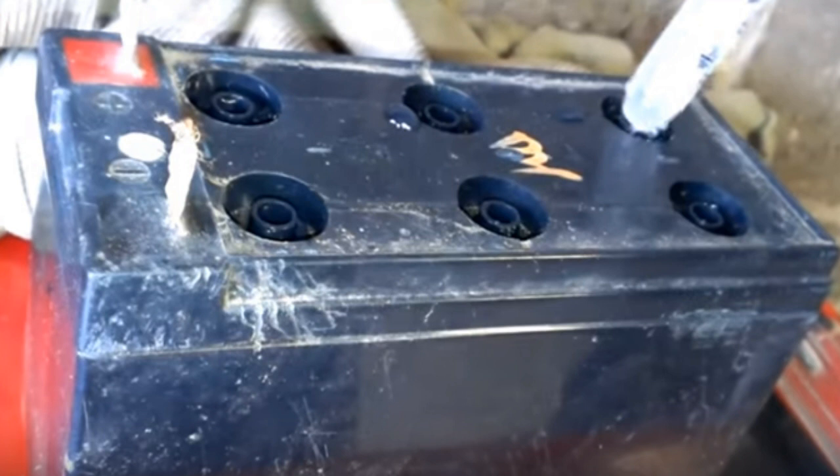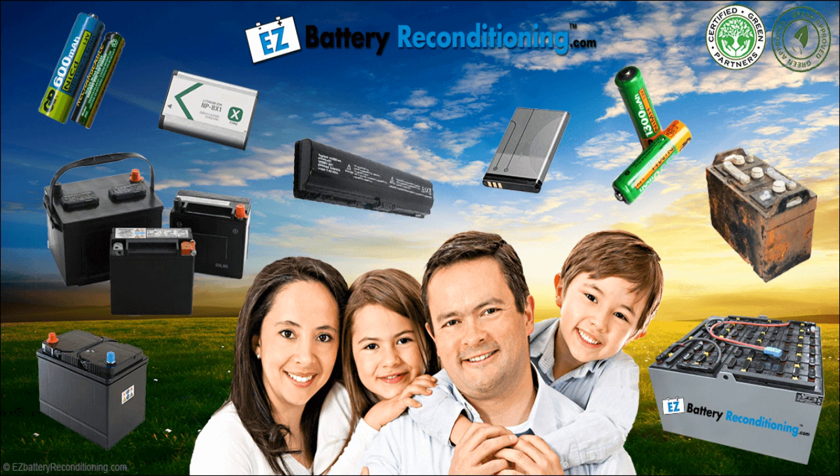Number 2: Industrial or Forklift Batteries. A battery bank that uses one or more industrial batteries follows the opposite philosophy of a golf cart battery bank. Instead of relying on multiple strings of smaller batteries, you use a few or even one battery to store all of your energy. Because these batteries aren't usually manufactured to standard dimensions, you'll have to have one made that is just right for your needs, or find an old industrial or forklift battery of the correct size. Like golf cart batteries, there are sometimes ways to get free or cheap forklift batteries — call up industrial companies and see if they have old or dead ones, and offer to dispose of it or pay a little. You can then recondition the battery instead of buying a new pricey industrial battery.